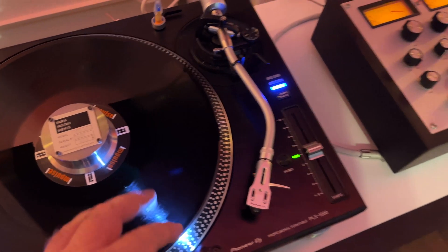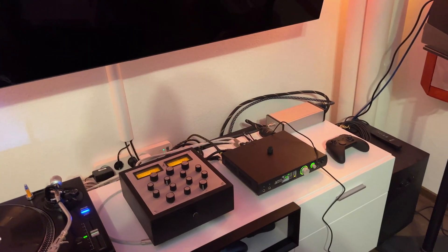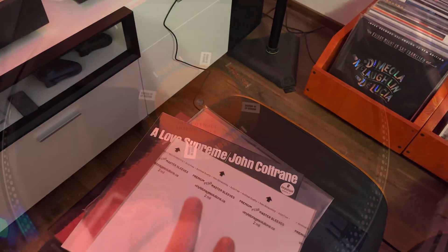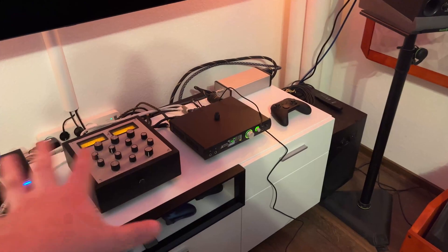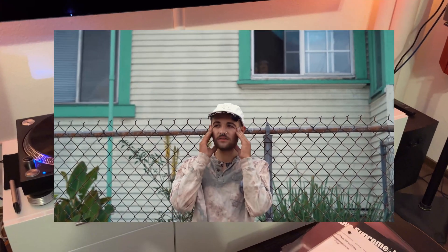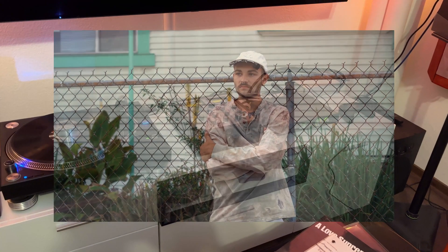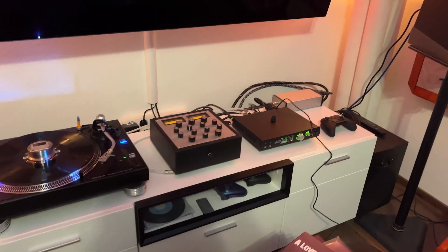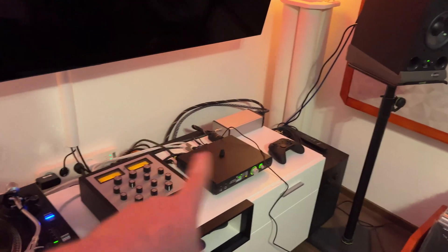I was recording the end of the first song and then the beginning of the second song, which is one of the most famous songs from Coltrane. I was listening to the quiet parts, the in-between parts. Obviously you have the tape hiss and everything because this is directly made from the analog master tape. But interestingly enough, using the Prism directly in balanced mode turns out to be noisier. It just doesn't sound as good — the higher end of the frequency spectrum is simply dull, and that might be due to the inductance of the inputs.